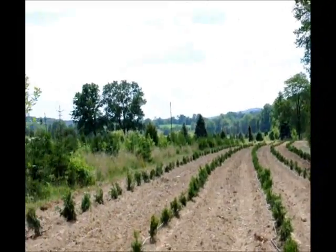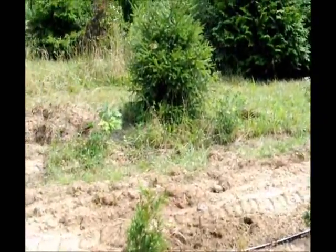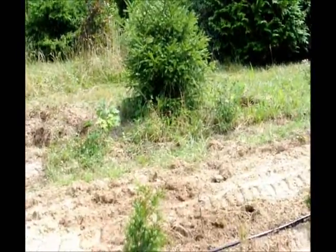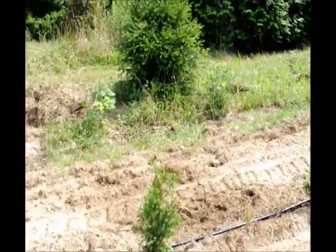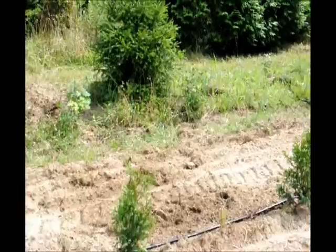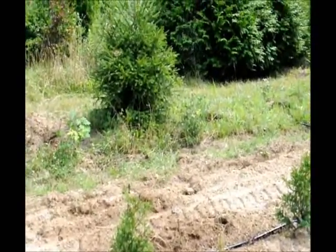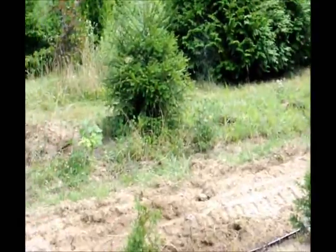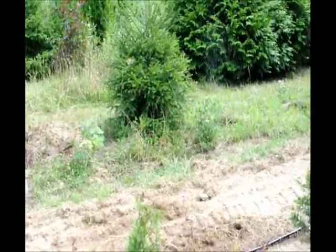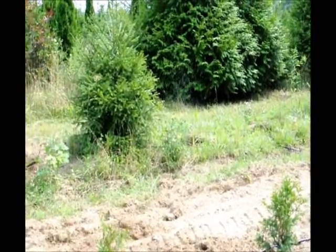If we see places where the tape is broken — like over here, you can see there's a small break — we'll go back and put a union in that spot and reconnect it. The tape can break because rodents come along and chew on it: things like mice, foxes, dogs, and rabbits doing the most damage. We find that we have to repair these about once a week. One small leak like this isn't too bad, but we correct them every now and then when we see a bad leak.